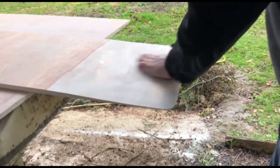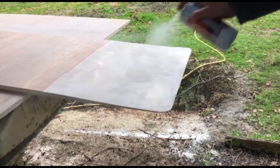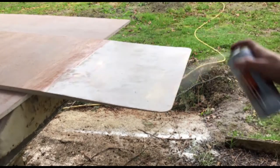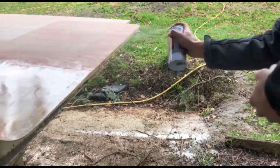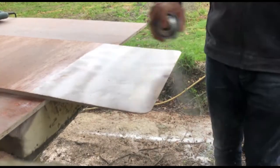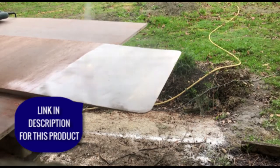I'm now using Plastico Quick Dry Gloss Lacquer — only 15 minutes between each coat so you can apply it really quickly. I'm applying it to all the surfaces that are in direct contact with the concrete. It gives a really slippery finish which makes it easy to release from the cured concrete, so I highly recommend it. I've put a link in the description for that product along with every other product used in this video.